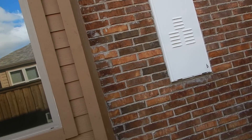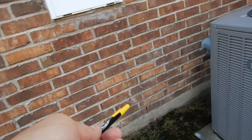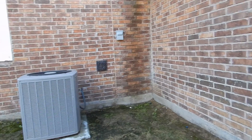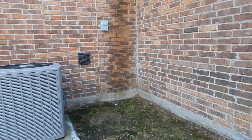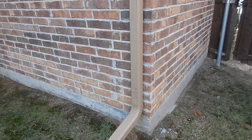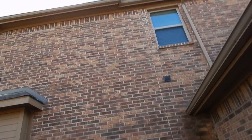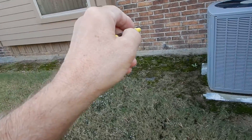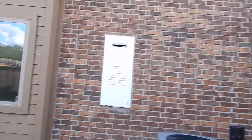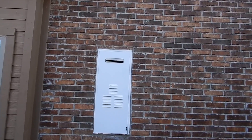This is the water heater. These are weep holes. Any time you have a horizontal plane above your masonry, you should have a weep hole there too. Brick is a great product — it's fireproof, a great insulator for both energy and sound. But one characteristic of brick is that it's porous. So we install weep holes around the foundation perimeter and around your fenestrations. Most of the time you just see vapor come out, but if you have an event, they will leak. We do not have a weep hole over here.